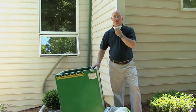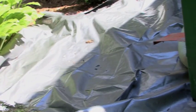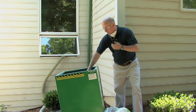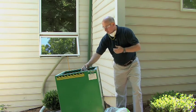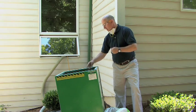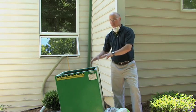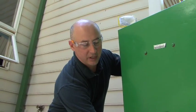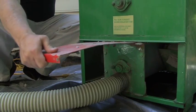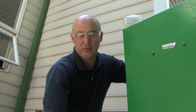Here's the machine that we got to use for free when we purchased the insulation. Before we got started, we laid out a plastic tarp because some of the material spills over and you want an easy way to clean up. We simply put the material in the machine — there are some safety features, so you want to read those carefully and keep sticks and children away from the machine. You'll probably use about a half bag at a time. On most machines, you hook up your hose and when you're ready to turn the blower on, you pull this plate out about three-fourths of the way, which opens up the hole to allow the insulation to go down through the hose.